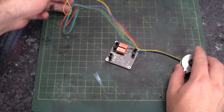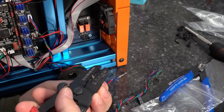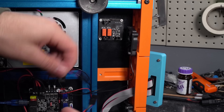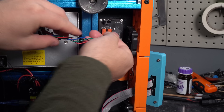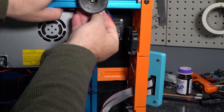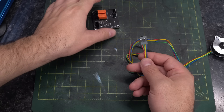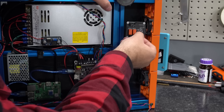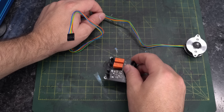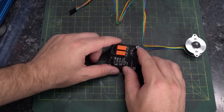When you wire up your motors and do your wire routing, you install your motors as you normally would, and the other end connects to your controller board as normal, but you need to put this board in the middle. The kit comes with pins and connectors, so you're going to have to do some stripping and crimping. Make sure the order of the wire colors remains the same going in and going out. Remember, there is no universal standard for wire colors on stepper motors — every manufacturer can do it differently. You can mount this board using M2.5 screws or double-sided tape, but if using tape, make sure you don't mount it to anything conductive since the pins can push through.